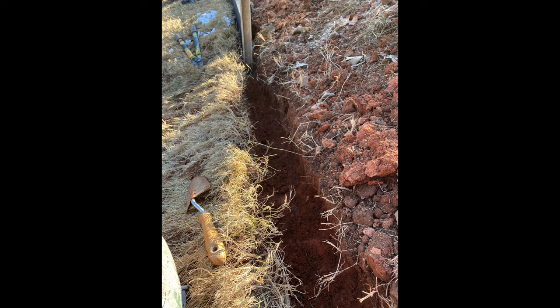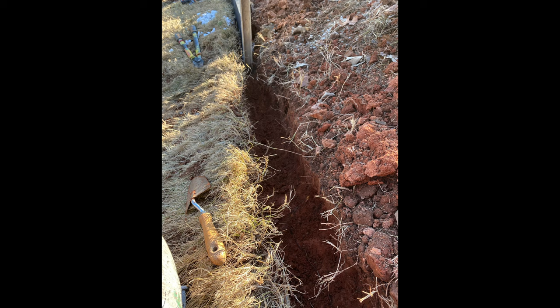This is the trench that we really dug out here. The main tool we're using is just a pickaxe to dig this, and then we have a skinny trenching shovel that's that exact width, which you slide down there to pull out most of the material. And then loppers to clip any roots — you can see the loppers in the background, because we're hitting so many roots. And a little hand spade just to get in the little nooks and crannies.